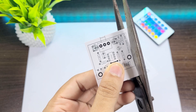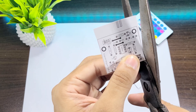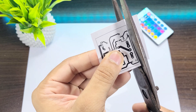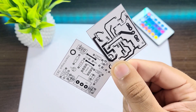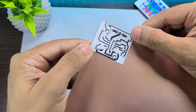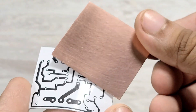Next, cut out the top layer and bottom layer from the printed layout with scissors. Then place either the top silk layer or the bottom layer onto the copper clad board, mark it precisely, and then carefully cut the board.